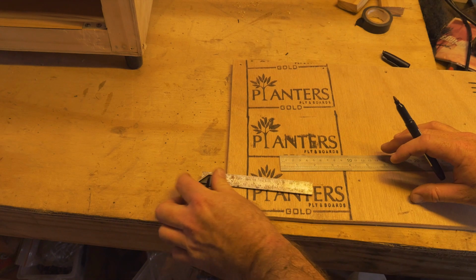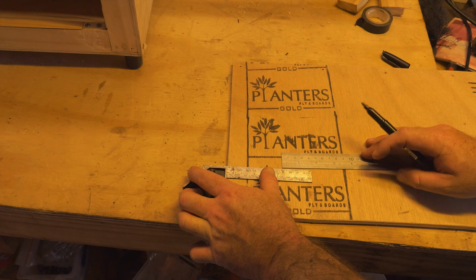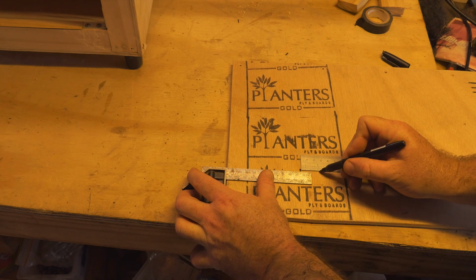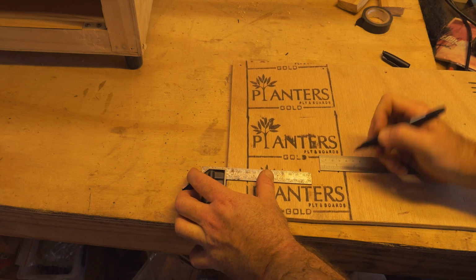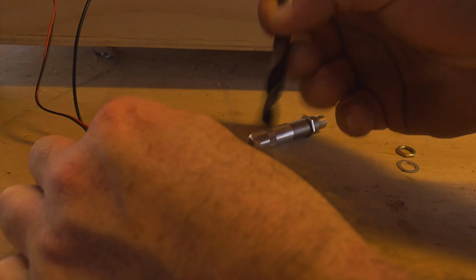It's entirely up to you. You may decide to put your 1/4 jacks on the actual side of your Apprehension engine. I just feel that having them at the very back is very similar to the original one that Mark Korven created. However, again, it's entirely up to you. So the measurements I'm using are 3 inches from the left-hand side and 3 inches from the bottom, and then an inch apart for the spacing for where I want to put it.